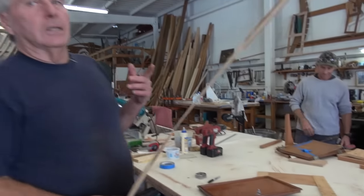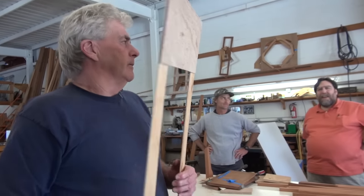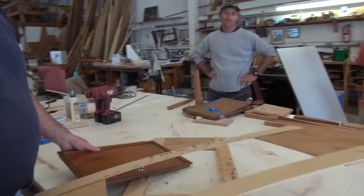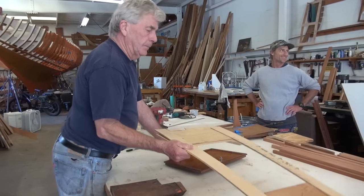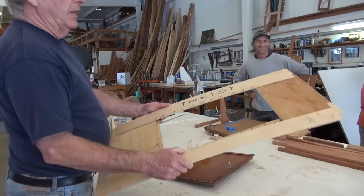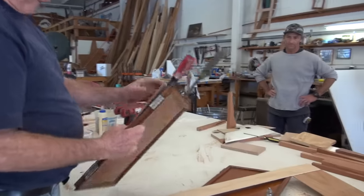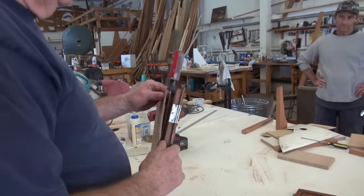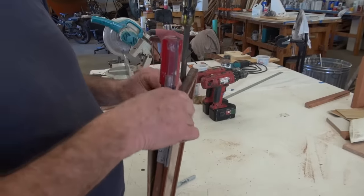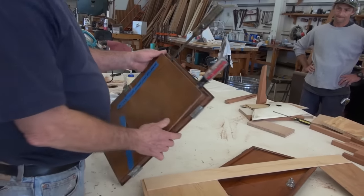Well, we lost a closet. It was a walkthrough — well, it was just a closet. You could walk through it, but nobody ever did. Only if it was really raining. Now these doors, much like a lot of them, were just dried out and delaminating. So we're going to pry these open, take the screws out, pry it open, and glue it back down on the bench so it's flat. They're just delaminating, but fortunately we can get them apart.